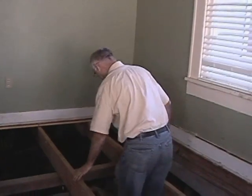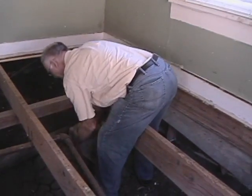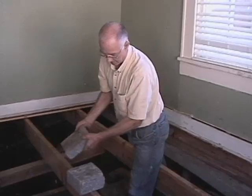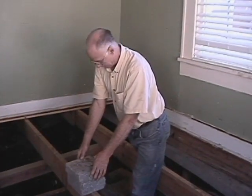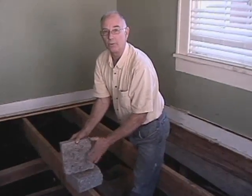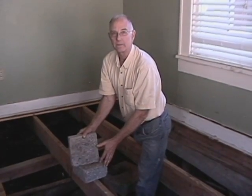As the concrete was hardening, they would lay the ledger beam, stick a nail in there just to keep everything stable until the concrete dried. When the house starts moving around, foundation companies come in and use what's known as pad and pier. I'll show you the ones you're not supposed to use — these are what they call low density concrete. It's got a lot of air space in there. You want the high strength concrete pad and piers.